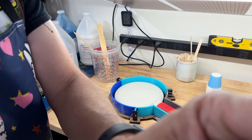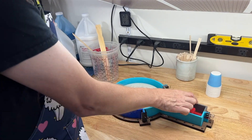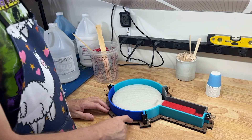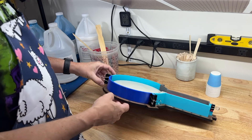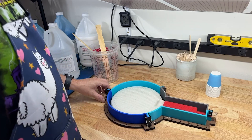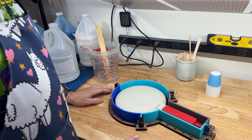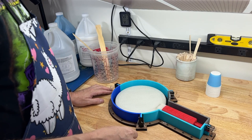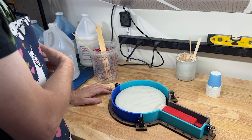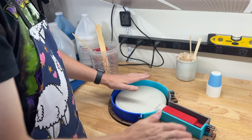The master model is mounted into the mold box, and you can see that the mold box is multiple pieces — we've got two rear pieces and two front pieces, all held together with binder clips. I have a laser-cut base that's two layers, just to help make sure that everything stays seated and proper so that if I need to pick this up and move it, I don't have to worry about messing anything up. It also makes sure that the base is squeezed together, even though I've waxed it so the seams don't leak, which helps keep everything true.